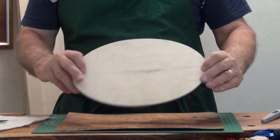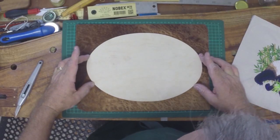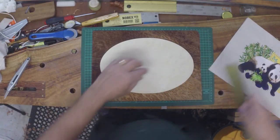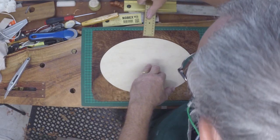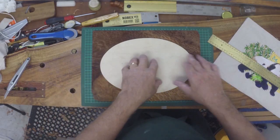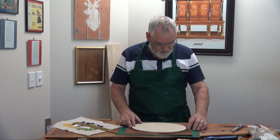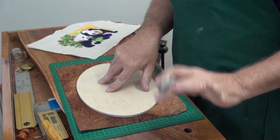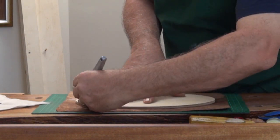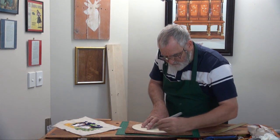Now I'm going to put this oval — I've got a little bit of double-sided sticky tape there — and place it so it's central. I'll get my ruler and measure in from the sides, and measure top and bottom. About 320 each way — I reckon that's pretty well spot on and central. You could mark centre lines here and here and line it up that way, which could be an easier way of doing it. Now I'm just going to trace around using a knife and cut that oval out — not in one hit, but in sections. You will hear and feel when you're actually through the veneer, then move on to the next section.